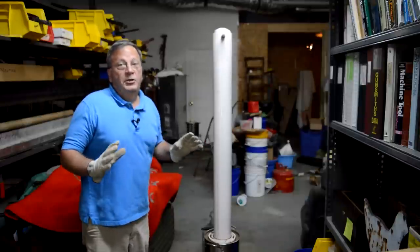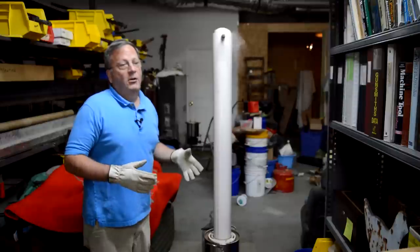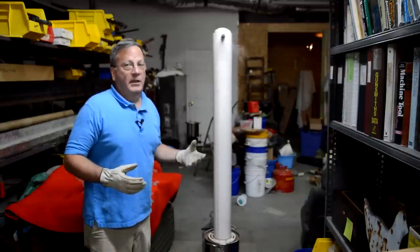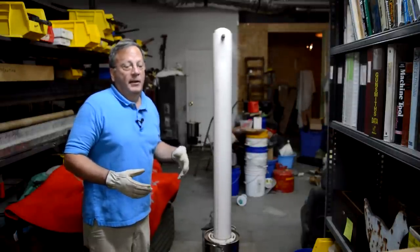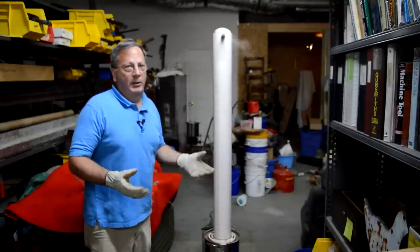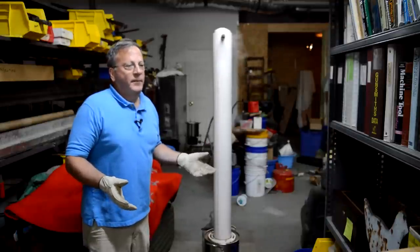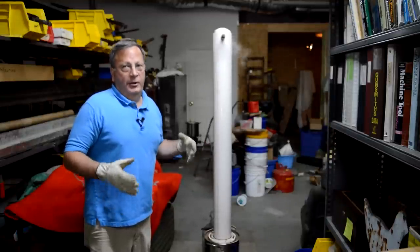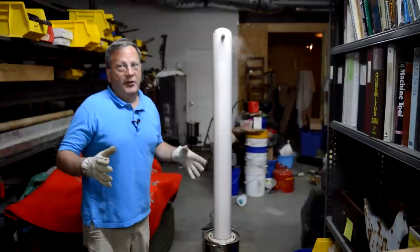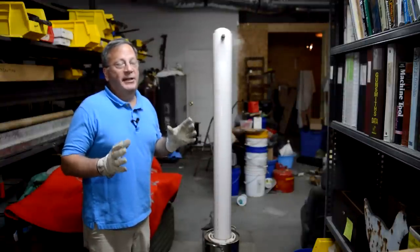Well, that's not what industry did back in the day. Beginning in about the 1850s and on through World War I, most military firearms and commercial firearms at the time were rust blued. It started out as slow, cold rust bluing, where it took days and weeks to rust blue a gun. Well, that's not good enough for industry. When there's a war coming and I have to produce 1,000 rifles a day, I have to have some way to do it. And that's what came to be known as accelerated rust bluing.